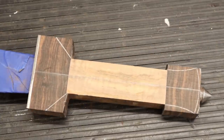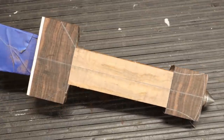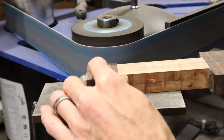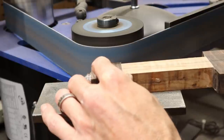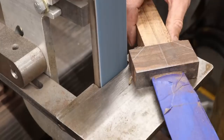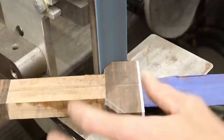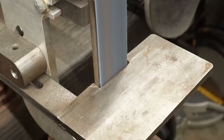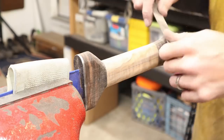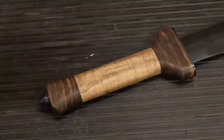I've drawn out the rough shape of the handle that I'm going to grind in on the grinder. You can see I've got a flare on the back and a flare on the front. The sides are nice and flat and true, so I can lay it on its side and use the contact wheel to cut in the sides. That was a tricky cut because you certainly didn't want to cut into the actual handle portion — just the angular portion. Then I rounded everything off with files, bringing it to a nice symmetrical shape.